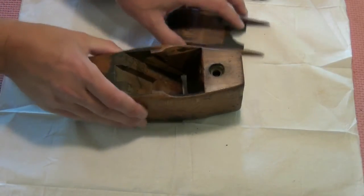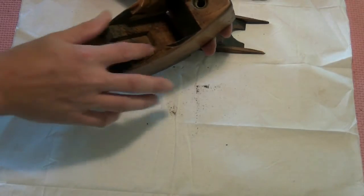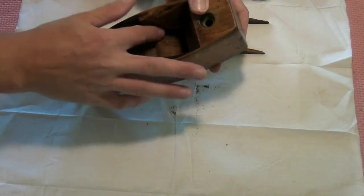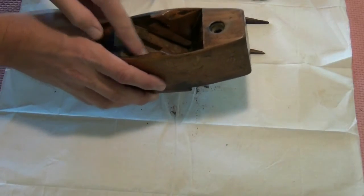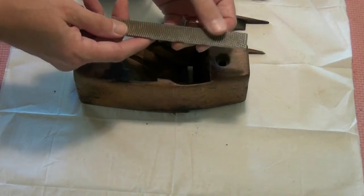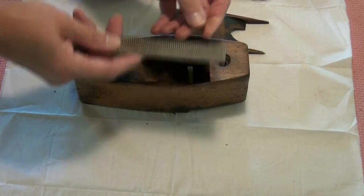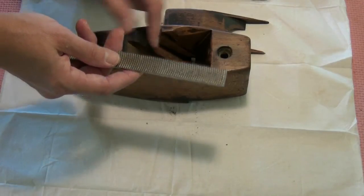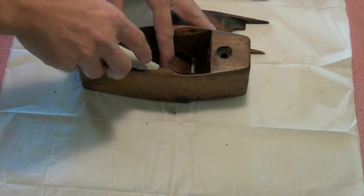I've had a bit more of an inspection with this plane and I'm quite pleased. The ramp is pretty smooth and appears to be pretty flat in the same plane as well, so I'm not going to do much to that. I have a Japanese file here which actually has more of a planing action to it — it can take very light planing strokes and it's flat as well. So I'm going to just clean the ramp very slightly with that.